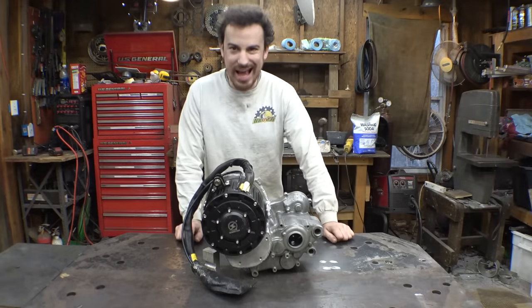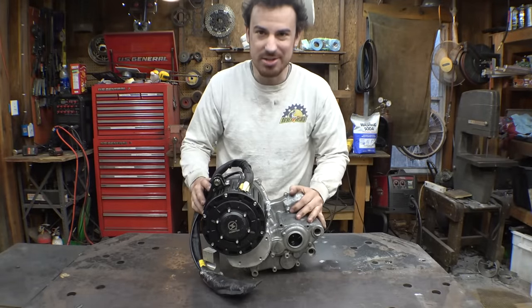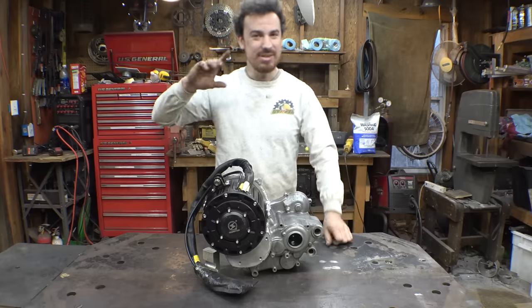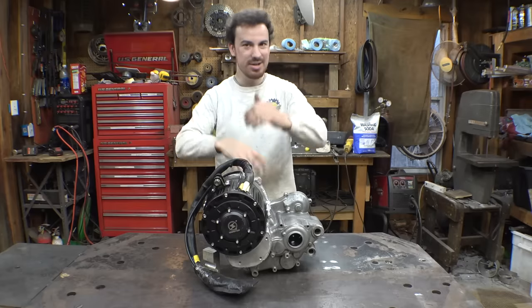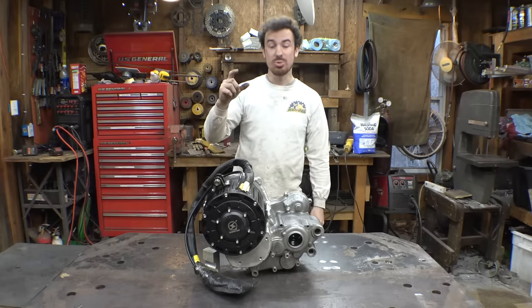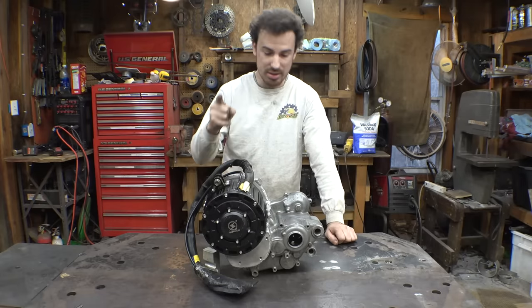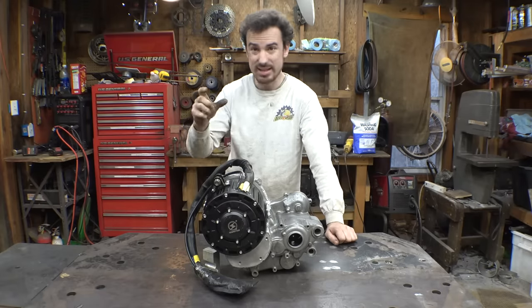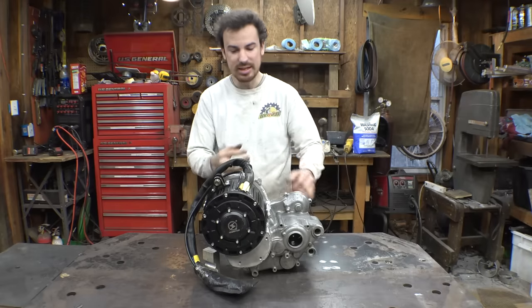So, today we are starting part 3 of the 6-speed electric dirt bike projects. If you haven't seen part 1 or 2 yet, definitely go check those out so you have a good idea of what I'm doing and why. First, we need to machine the other gear, the one that's going in between the electric motor and the clutch basket. Then we need to heat treat these parts so we can get them in place and finalize everything.